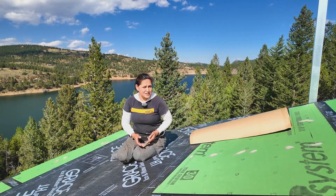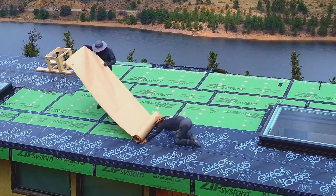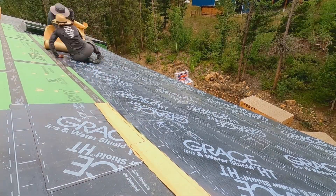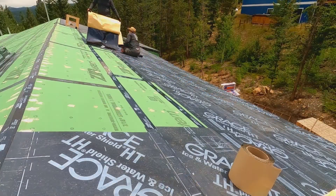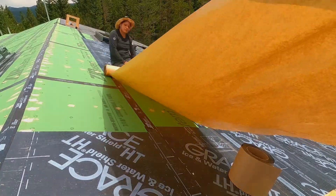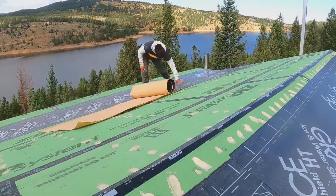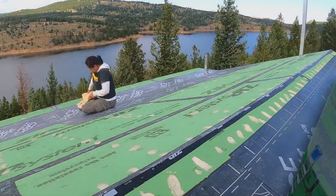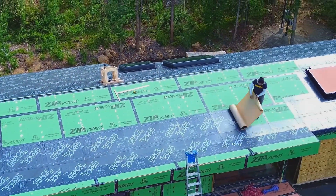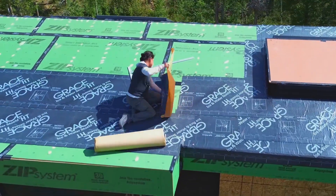There are two methods of installation. The first is bringing the full roll to the roof and rolling it off — the back-roll method. It's super fast, but the disadvantage is it's easy to lose alignment. You just pick up the paper and pull it, and the membrane stays behind. I'd recommend this if you have very long distances and two people to check alignment and make adjustments. The second method is pre-cutting the pieces you need. The instructions recommend around 10 to 15 feet, but you can really cut them to the size you need. The pre-cut method is more manageable, and if you're working alone I definitely recommend it.